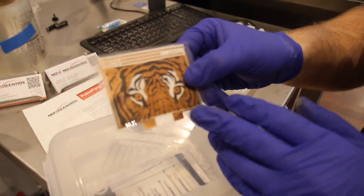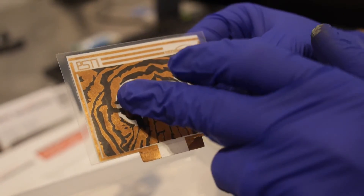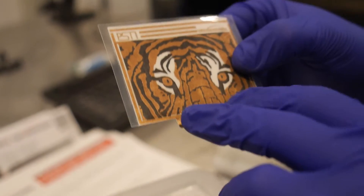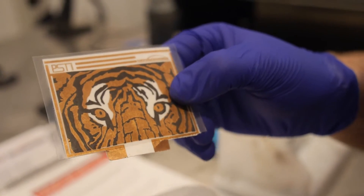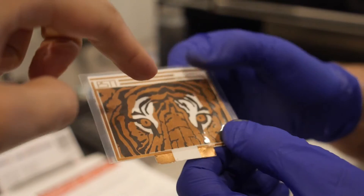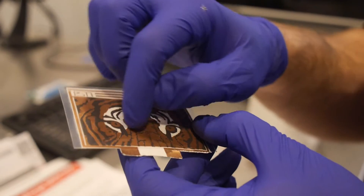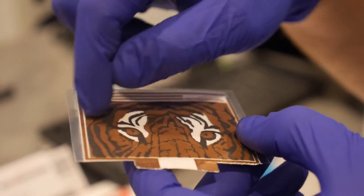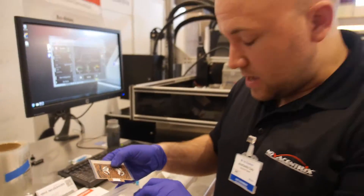This is a little tiger. The orange is our copper ink — copper screen printing — combined with PST's silicon ink. As a function of temperature the resistance changes, and you can turn that into a temperature signal. So PST is using this in screen printing, which is a little slower. We're providing the metal layer, and they provide the silicon print.